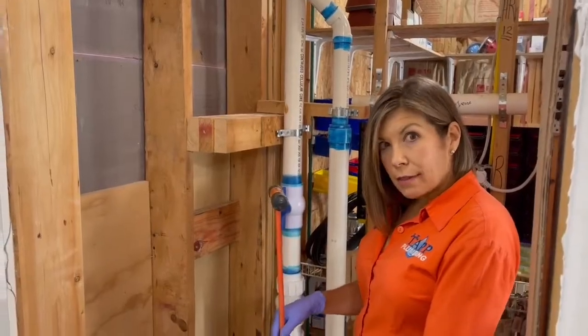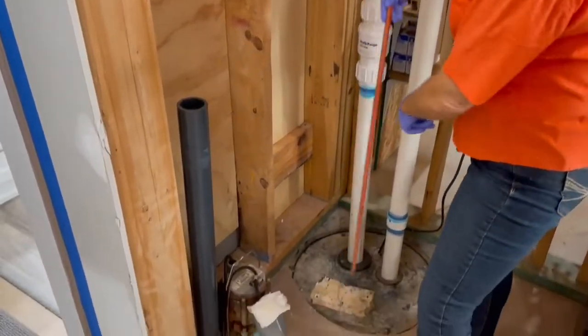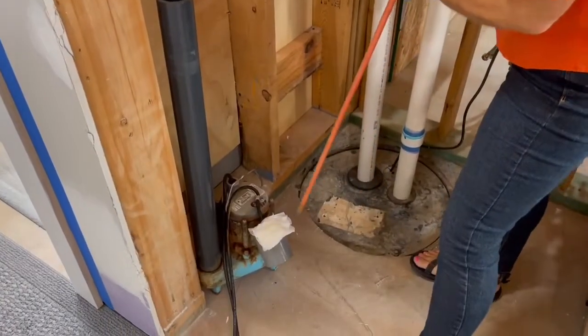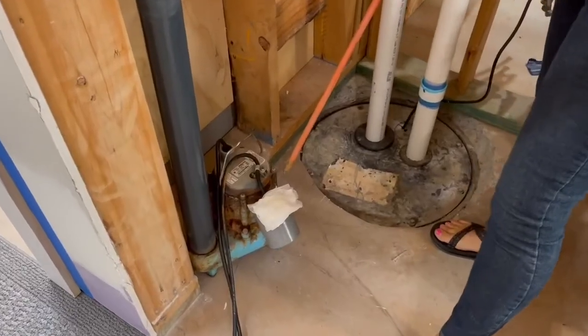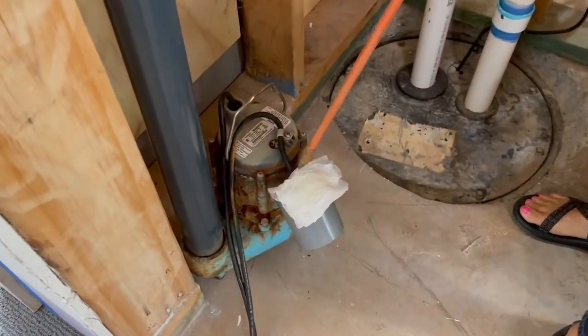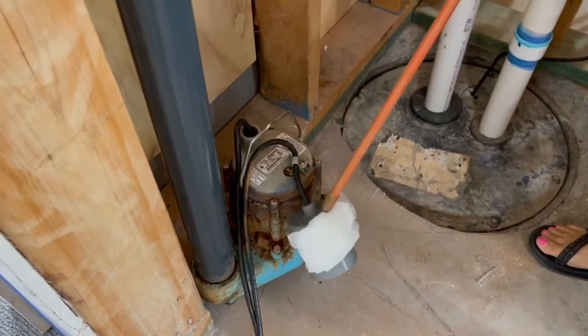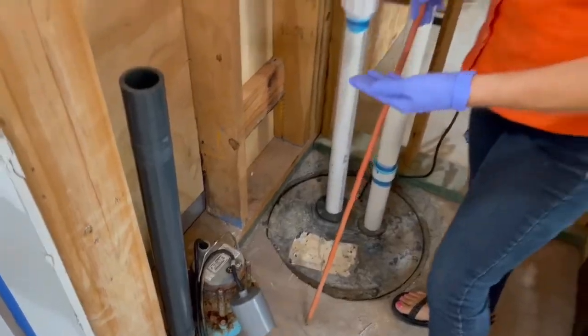I want to show you outside the can what you're wanting to accomplish inside the can, through that little hole in the grommet. You want to take a broom handle or a probe — whatever you have — and also a flashlight to look inside the can. What you're trying to do is knock the toilet paper off the float so it'll allow it to activate the pump.